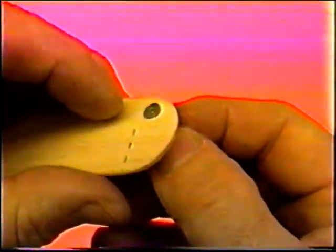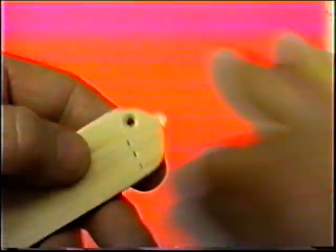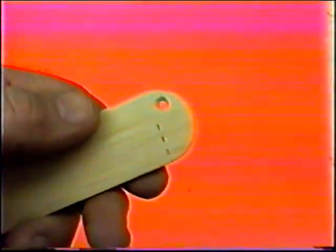Now if you press that screw in just a little bit, actually the first time you tighten it up it'll leave a little impression, then you can harden that impression up with some thin CA, and it gives you just about the right countersink, so that little bolt head, when it's finished, you don't catch a towel on it every time you wipe it off.